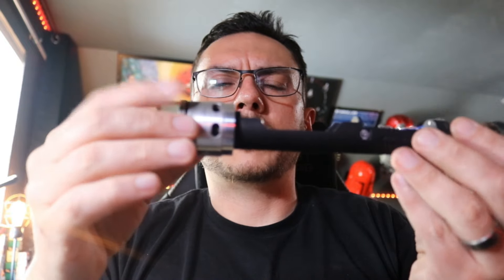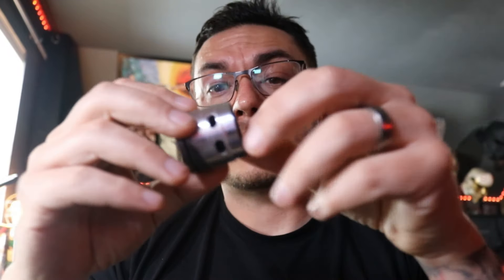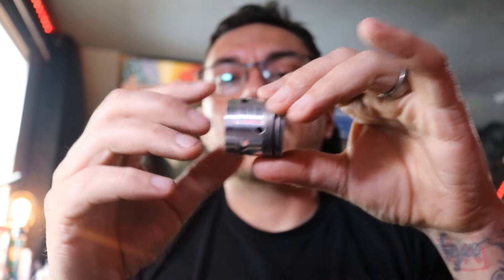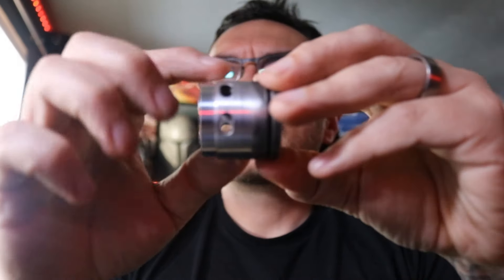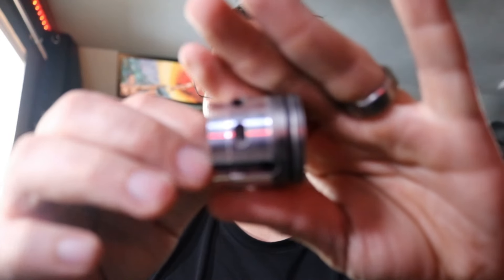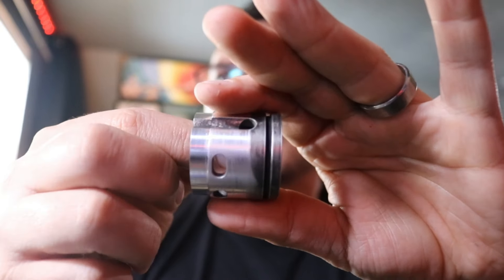You've got a spacer here in the pommel - don't take that out, it's just a press fit. That's there to have something for the speaker to rest up against and it pushes it forward into the saber. When this saber came, this pommel was absolutely impossible to get out of the saber. I reached out to Austin and talked to him about it - he was having some of the same issues. The kit comes with this pommel where it is just locked in. What I did was a little bit of sanding on the inside diameter, but I wasn't getting very far with that, so I ended up locking it into my lathe and machining off just a little bit. I stopped right shy of where this pommel would be visible when it's locked into the saber, so you won't see any of the shiny part, but I did take it all off where you can see it. So it does come off a lot easier that way - just know that's why the difference in color.